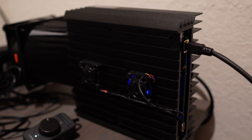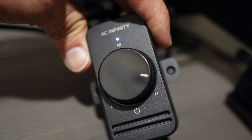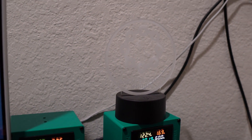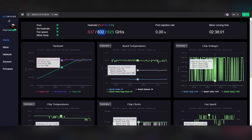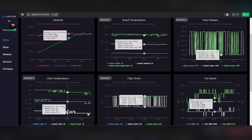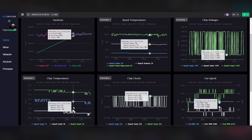I'm pretty happy with this — it's been running nice and steady at 632 gigahash. Board temperatures are fine. I have a custom 3D-printed shroud blowing air down the middle of the KS0 with 1238 fans attached to it (Amazon affiliate links in the description). I've got my 240-watt power supply with a little air blowing over it from the ASIC itself. Voltages chop between 470 and 480 but the hash rate's pretty steady. Chip temperatures seem high, but this is where the Ultra wants to be.